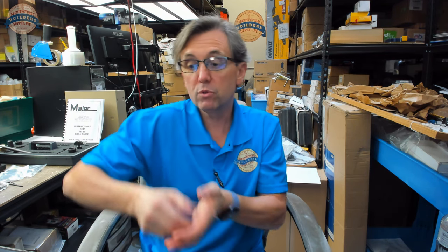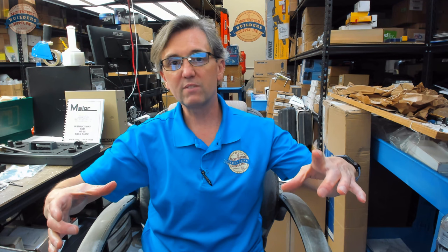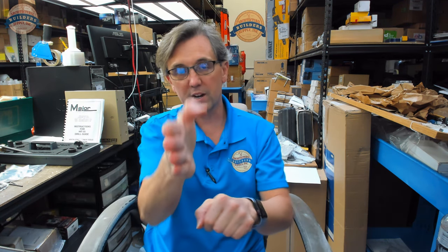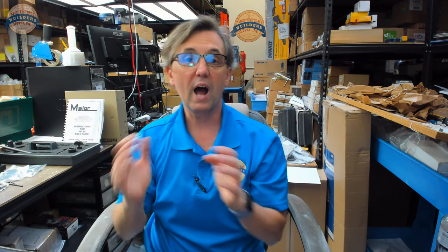Drill halfway through, you've got to clean out all the wood that's now packed in there. Go to the other side, clean the hole out. Generally really good, nice and tight. Those bits are long lasting and very inexpensive. Then a 1 inch spade bit right down to the edge. My Porter-Cable 517 centered. I mark it right in the center where my vertical center line is. Clamp that down, my router, corner chisel, I'm done.